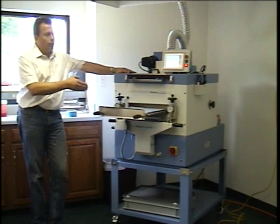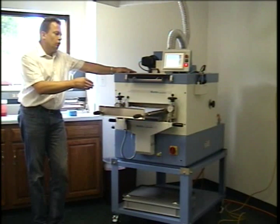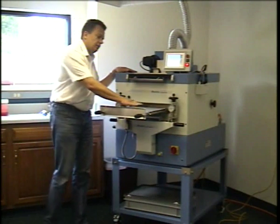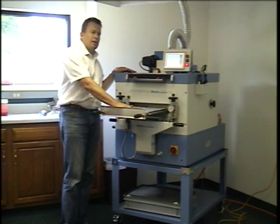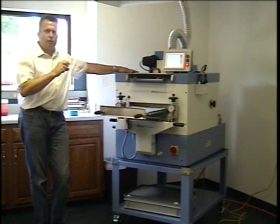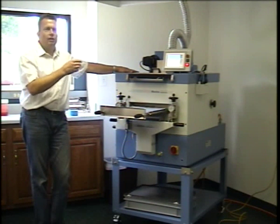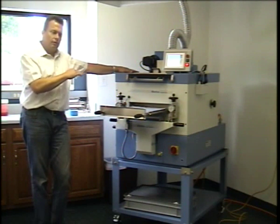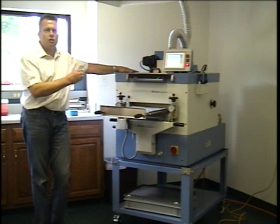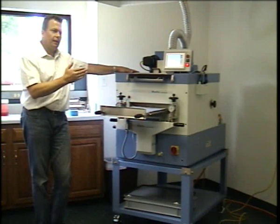I didn't mention before, but you would have another option as well. You could set the clocks to be 0 when the knife touches the fabric. However, because a lot of people have different or varying substrate thicknesses, it is not necessarily the best method, because you would have to readjust the zero position every time you change the substrate. If you have the same substrate all the time, then that's no problem.